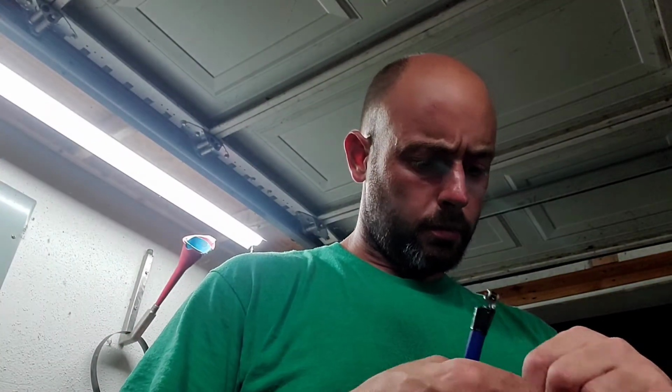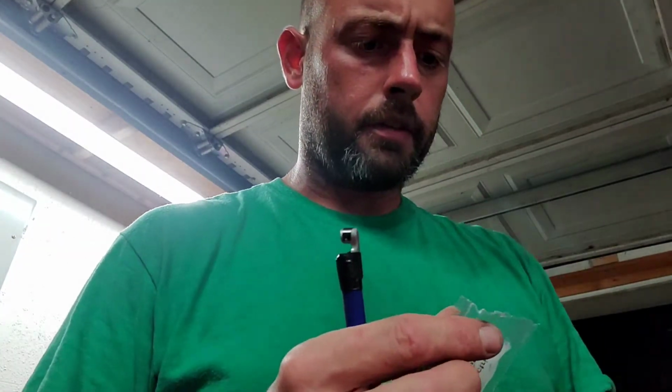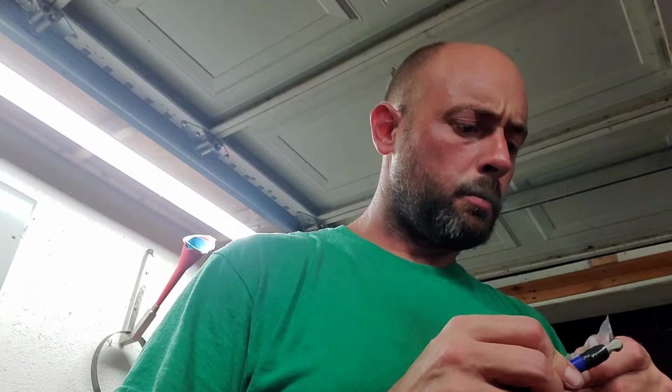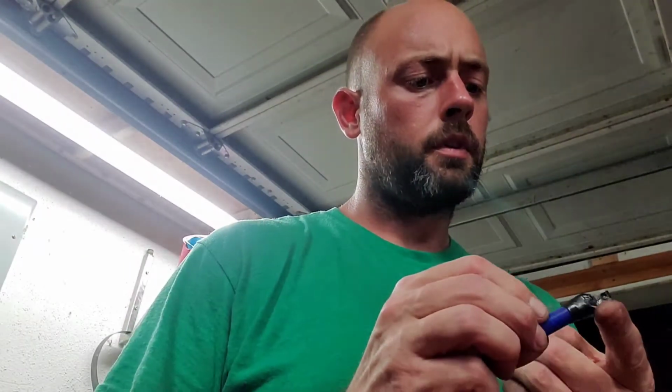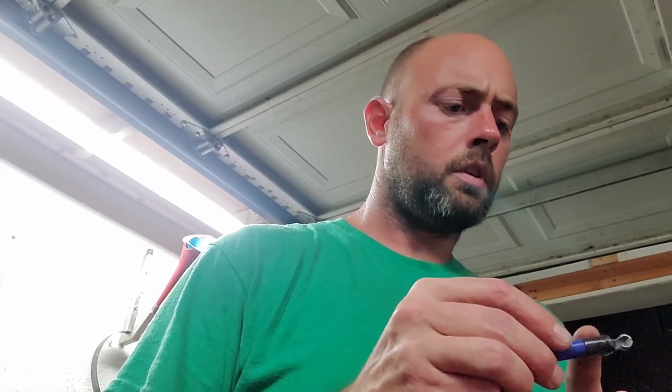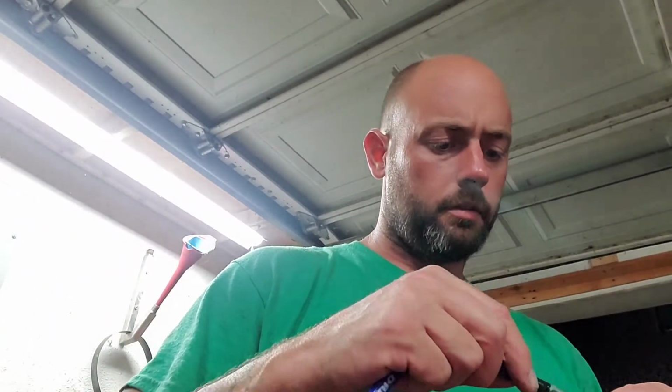So we'll just toss a little bit of this on there. You don't need a lot, guys. A lot of people put that down in the boot as well. It keeps it from sticking to the plug. I know you guys took some plugs off before, and that boot's stuck on there, man. It'll dang sure get stuck.